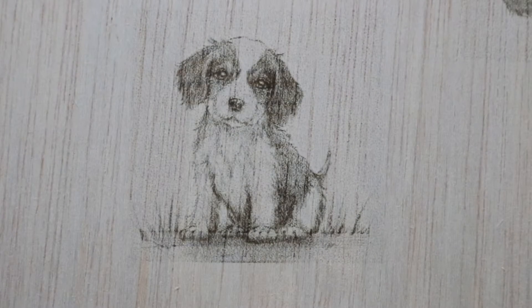Here is the final image. As you can see, it is very pale, so I made another run with a higher power of the laser and slower engraving speed. Here is the second image — it is much better, as you can see.